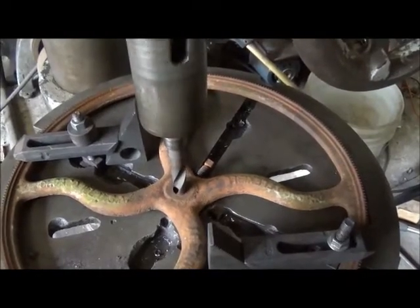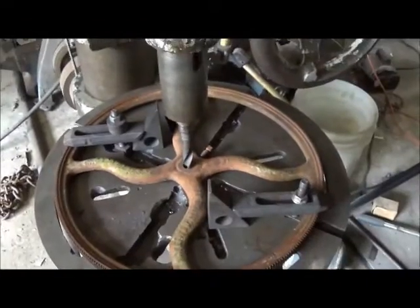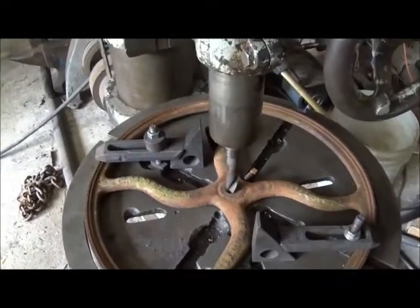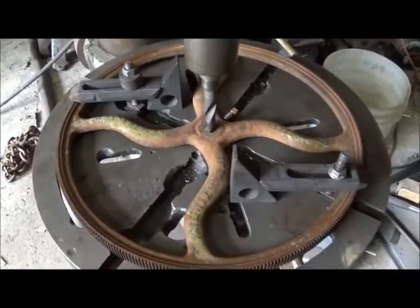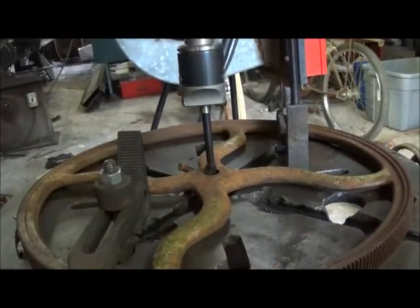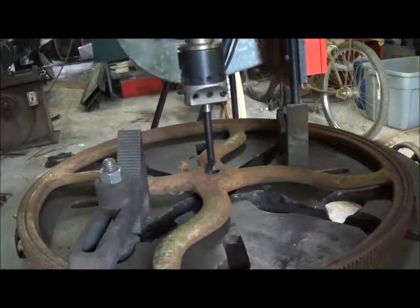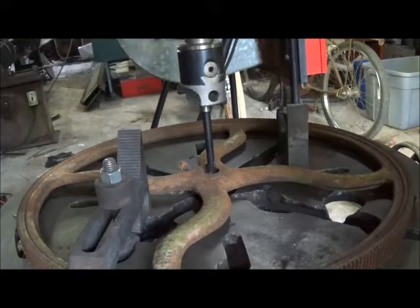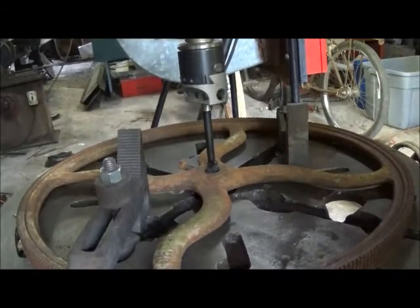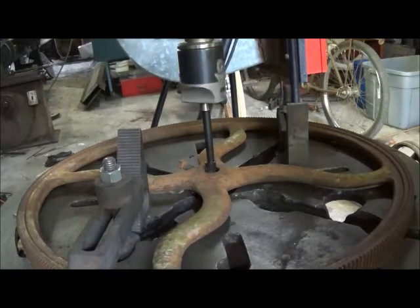I know this is not a mill, and I haven't tried it with one before, but it's got power feed on it so we're just going to see how it does. It's set up on back gears so it's going to be really slow, and the feed is real slow. I'm not going to put it in high speed — it's got four-gear power feed which would be real slow anyway. We're just going to feed it down one time and see what it looks like.